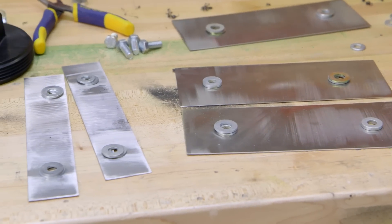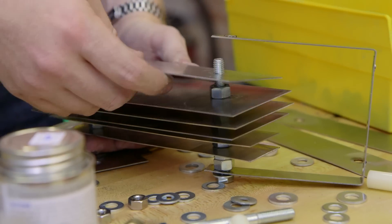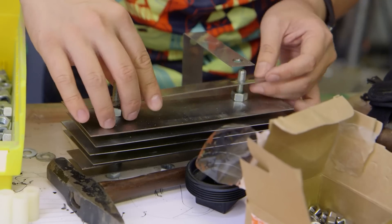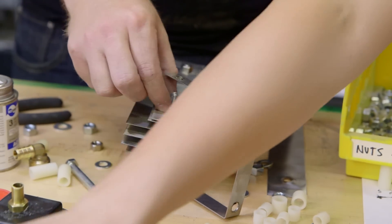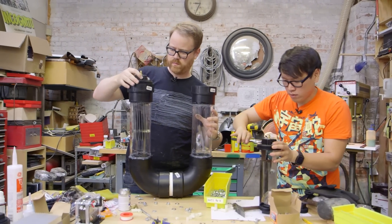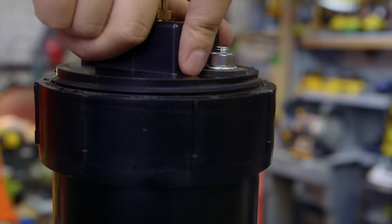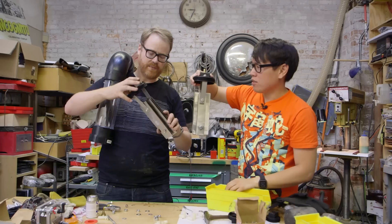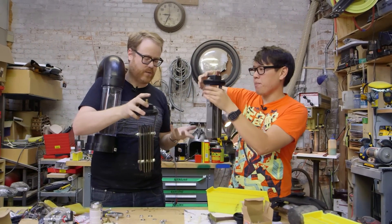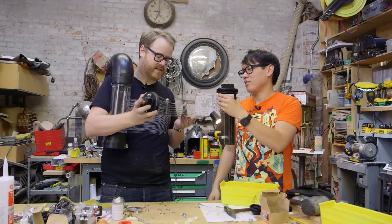Assembly, Norm. The way it's going to work is that the brackets are going to fit up inside the head. Bolts are going to go up and we're going to connect our electrodes to them to generate the hydrogen and oxygen. Then we're going to run these plates through a couple of bolts and dangle them down into the water. We made some thin plates that are an inch and a half, and some thick plates that are three inches. We're going to do a couple of thin plates, four thick plates, and a couple more thin plates, to fill up as much space as we can in the circular tube — more surface area. Put the brackets on either side, space them out with washers.